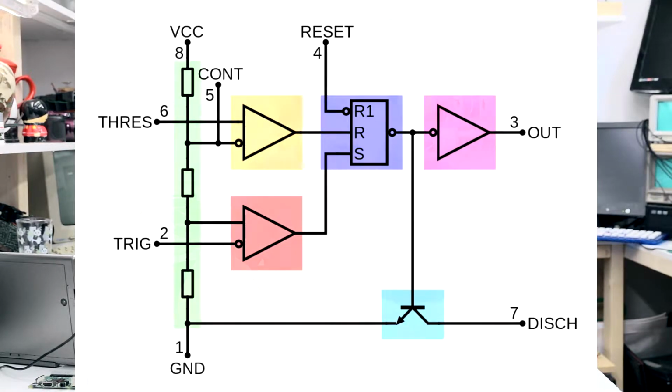Now, depending on the external resistor capacitor arrangement you use, you can make this thing do quite a few things. And in this example, we're turning it into an Astable oscillator, which means that the output constantly switches between on and off, or 0 and 1, or the high voltage and then 0 volts, depending on your outlook on life. Now, most explanations for the 555 Astable oscillator end there. They simply say you have an external resistor and a capacitor, and you get an Astable oscillation. But the MitchElectronics kit takes us a little bit further.